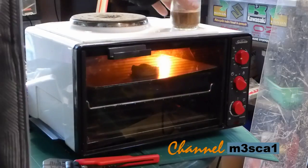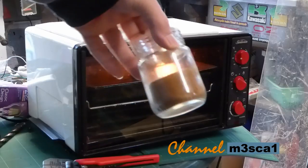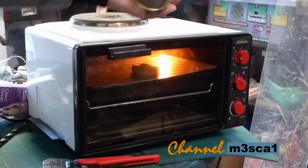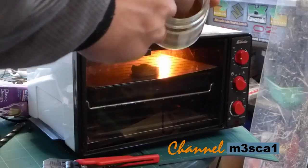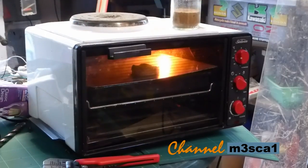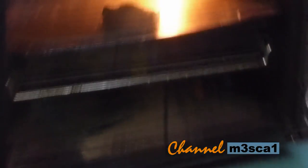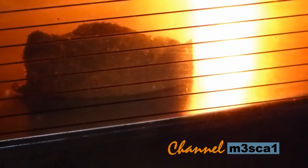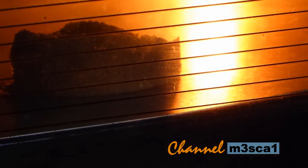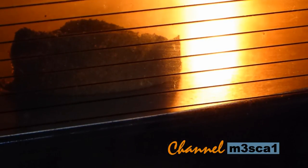What I've got here is this sand mixed with sodium silicate. Straight up sand and sodium silicate and it's starting to go rock hard on the top. There's also a sample in the oven there that has a little bit of clay in it as well, and that seems to have formed up quite hard as well. So I've just thrown that in there to give it a good cook off and try and remove all the moisture. Other than playing with plastics, I'm cooking off some refractory experiments.